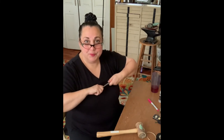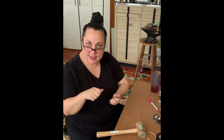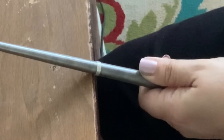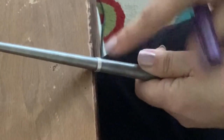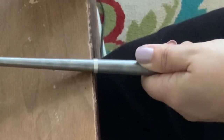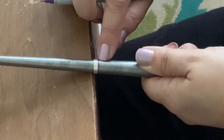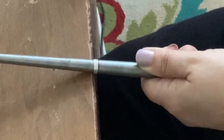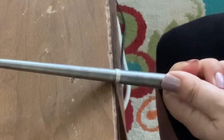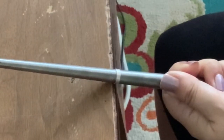Having the mark on here, when I slide this off and flip it over I can see exactly where my original mark was. I can whack it down a little bit, make a new mark, and get the other side to match. Here's a close-up of leaning the bezel against the bench — you can see the back edge is pressed against the wood so the force is moving the bezel downward. I mark a line right along the bottom. When it stretches, you'll easily see the line get covered up. There it is — line disappeared, so you know you've got it stretched.